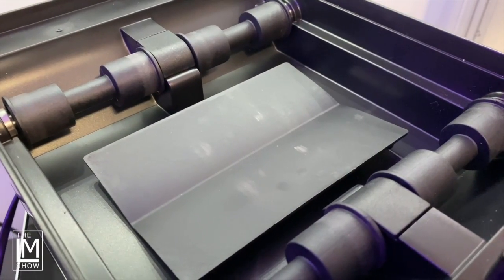Well, the FixDry has that solved. It has a bunch of vents in the top, plus those ten pass-through ports you can leave open to let moisture out. It also has a cool V-shape deflector above the heater in the bottom, so the heat is not directly on the bottom of the spool — it hits the deflector and flows up and around with a fan to keep the whole chamber at temperature for even drying of the filament.